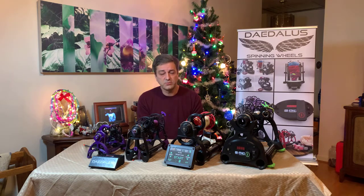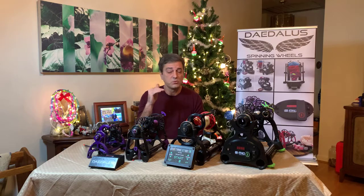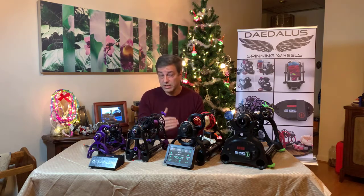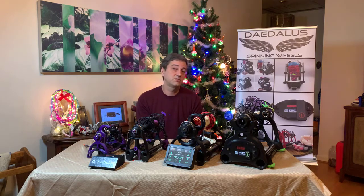It turns out that with all my testing, it's very, very intricate what that rear motor has to be doing at any given time. When it's starting up, when it's running at speed as you're adjusting the tension, and then when it's shutting down, that rear motor has to have a personality that's going to work with you. And the only way I could get that achieved was through microprocessor control.